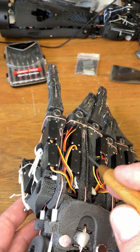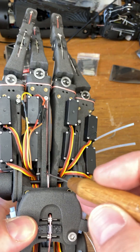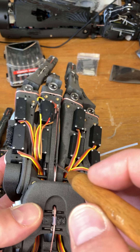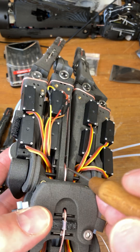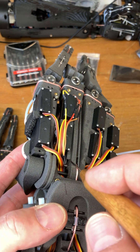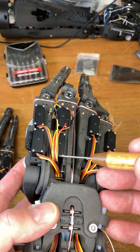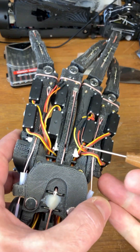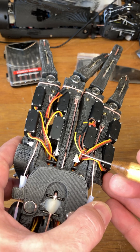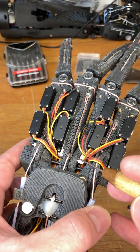Also from UV exposure — I suppose it's a bit better in there. Springs made of steel I think are going to last longer; they certainly are not going to corrode in the same way, especially if they're stainless steel. Also, as they stretch they have a linear spring extension, which means that when you pull them further they get stronger. The other problem with latex — if you think of when you blow up a balloon — is that it suddenly gets very easy, and that's what happens with these rubber bands as well.